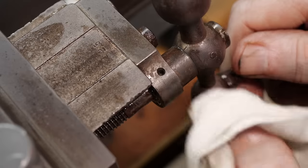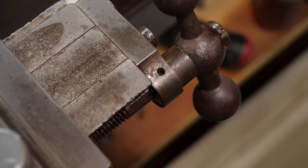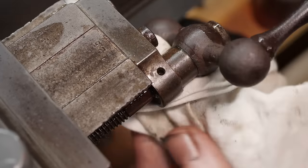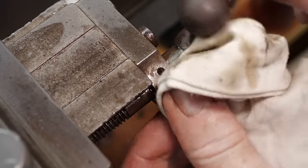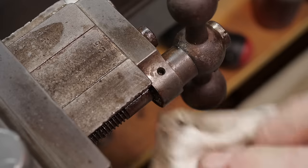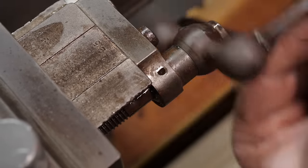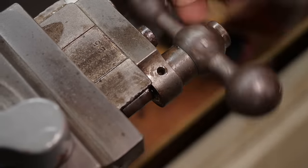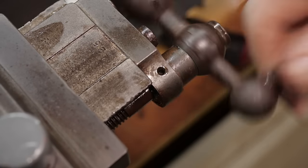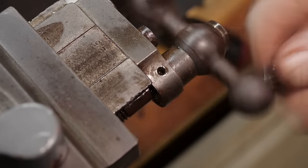I'm trying to make sure whenever I use displacer — this is definitely not actually WD-40 — whenever I use it, I make a point of removing as much of it as possible and then replacing it with proper slideway oil. The lighter parts of WD-40 evaporate off pretty quickly. The heavier parts are really designed to inhibit corrosion and are way too waxy to actually lubricate, which is why spraying something with WD-40 often causes it to run for a while and then seize up, as the lighter stuff evaporates off and the heavier waxy water protectors are left behind.